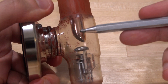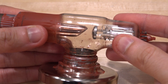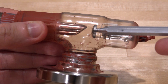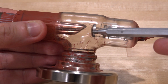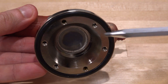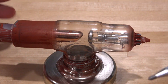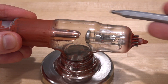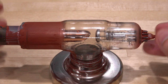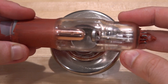They're going to collide with that angled surface right there. Now, that metal can be made of several different things — tungsten is quite popular because of its high melting temperature. Once you collide this, it's almost like hitting a ping-pong ball on an angled surface. The electron accelerates, hits that, turns into x-ray, and comes out of here and out of the beryllium window at the bottom, which is still intact. But some of the x-rays are just going to scatter everywhere — most of it is going to be guided down, but some of it would certainly leak outside from the other parts. So that's why this actually works: because of this strong electric field and the amount of energy we put into accelerating those electrons.